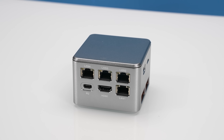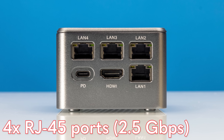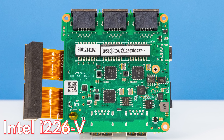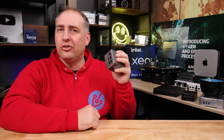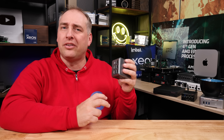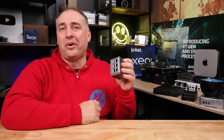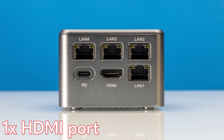On the main faceplate you'll see that we have four RJ45 ports — these are all two-and-a-half gig ethernet ports. Inside the system is the Intel i226-V, which is the newest revision. The i226-V has some new bug fixes, but some folks are seeing issues with consumer motherboards in Windows and some on Linux. We haven't really seen it running Linux on these, but we've been running this thing 24/7 just to see if we could make these things drop.